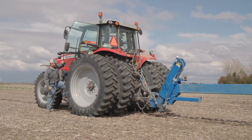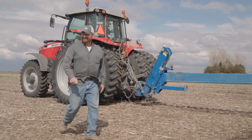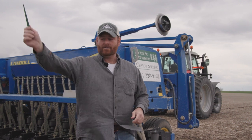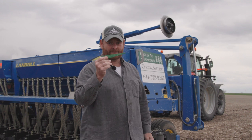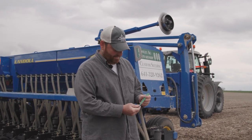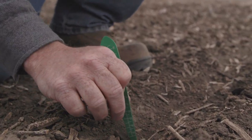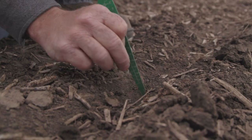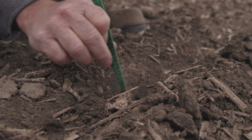To make sure that the machine is doing what you set it to do, you need to get out of the tractor and dig. Every seed company out there hands these things out every year, and farmers take them, throw them in the truck, and later when they clean the truck out, they throw it away. But they're really handy little tools because they have a depth gauge on them. It's really easy to dig in the seed trench — we can dig and that tells us how deep we're running, how well things are closing, and eventually what the spacing is.